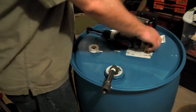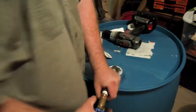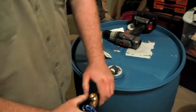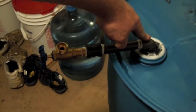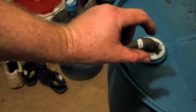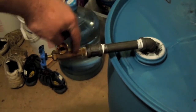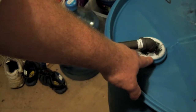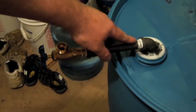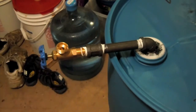All right, there you go. Here's the bung — drilled a three-quarter-inch hole in it, put a half-inch pipe nipple in there, screwed the 90-degree elbow to it, took the little plastic screw-in bushing off of the boiler drain valve, screwed it on the other end. Put some JB Weld in there just because I had some — that's probably overkill. Five-inch pipe nipple, half-inch coupling, half-inch boiler drain valve. You could do that with three-quarter-inch too if you wanted.